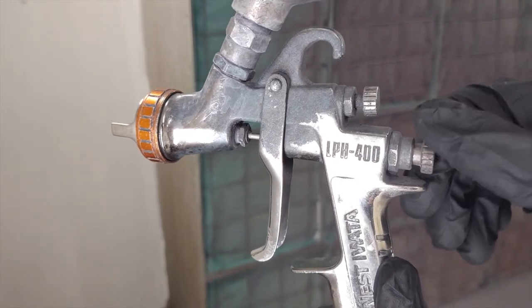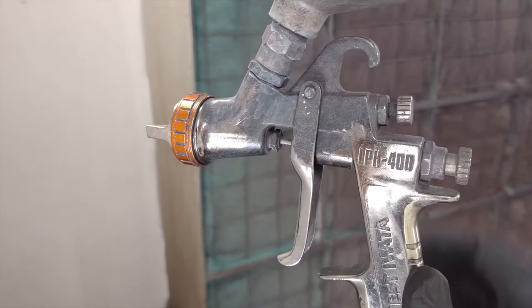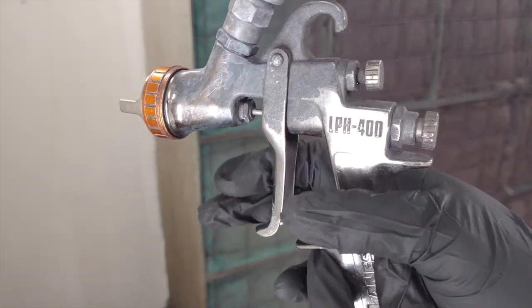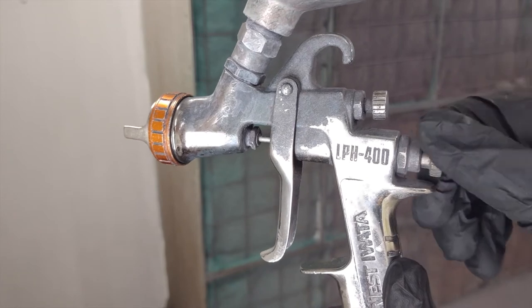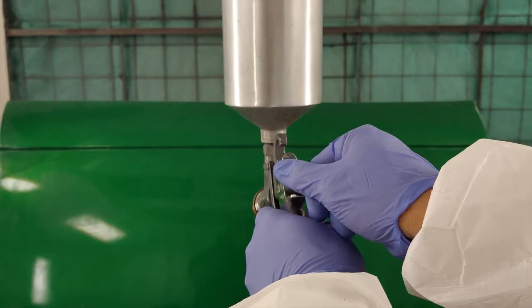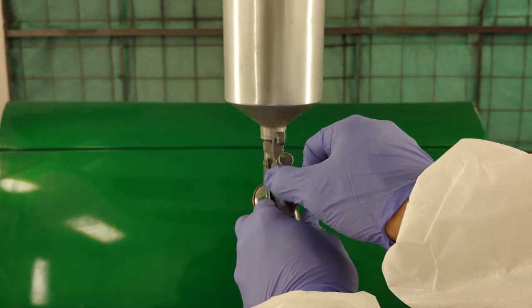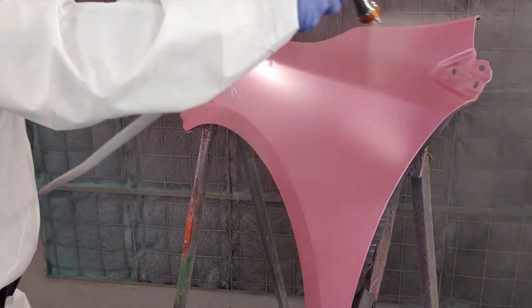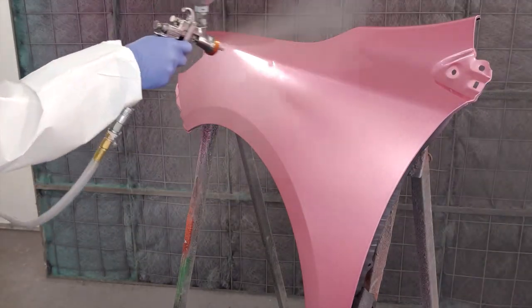One often forgotten setting is your fluid or trigger adjustment. The knob behind the trigger on your spray gun controls how much fluid is released to the spray head. Too much material results in large droplets and too much material applied, and too little material results in smaller droplets which can lead to dry spray. Each time you use your spray gun, it's a good practice to screw the fluid adjustment clockwise all the way to hand tight, then count the rotations as you turn it counterclockwise to open it up. With UC410, three to four turns out from hand tight is generally a good starting point. At this point, you're ready to do a test spray on paper or on your booth wall. Your spray pattern should be a tight and uniform ellipse. If not, you may need to clean some of the small orifices in your spray tip or air cap.